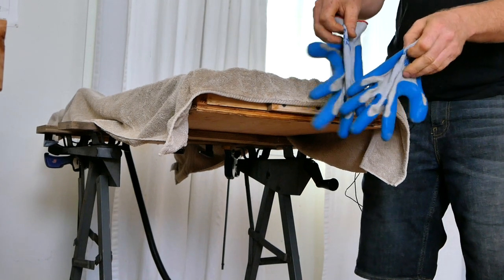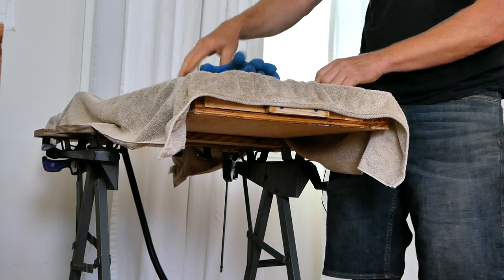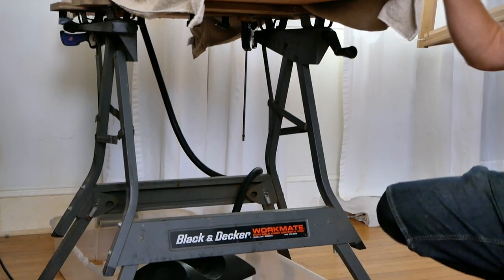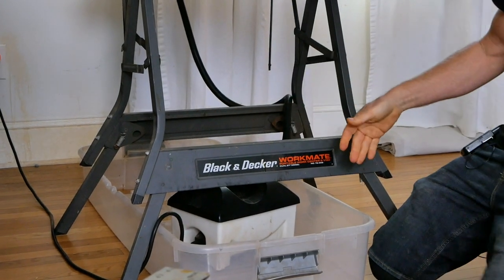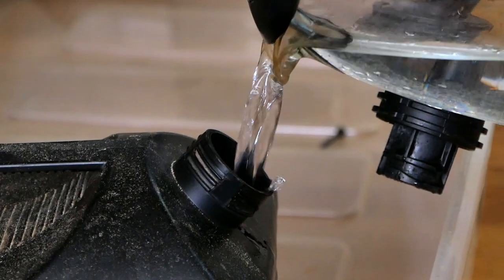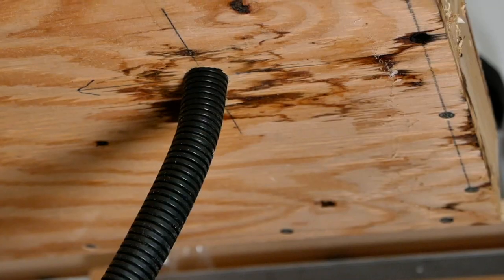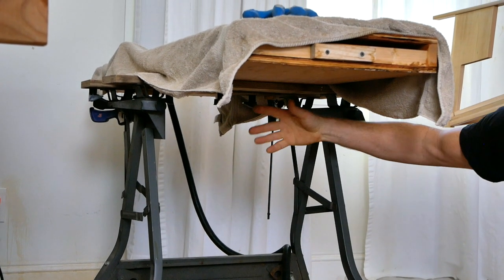On top I've got a couple of gloves — I really like this type for steam bending because heavy leather gloves don't give me the dexterity I need. For the rib ends, it's important to back those so you don't split out the steep bends, so I've got a chunk of an old belt. Feeding the steam box is a wallpaper steamer plugged into the wall, and I've also got a backup kettle in the other room. If it runs down on water, I can quickly replace it with boiling water — pouring cold water in would interrupt the steaming cycle and cost me the ribs stacked in the box. When re-steaming ribs, I move the hose to the center of the box for better coverage.